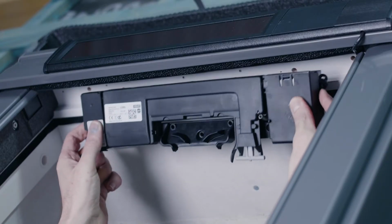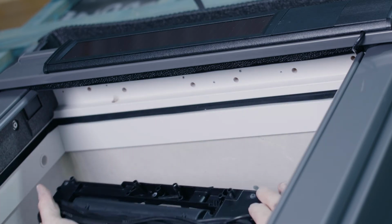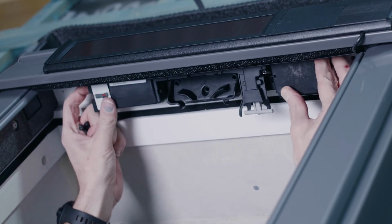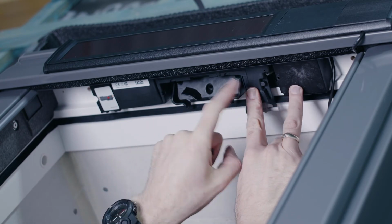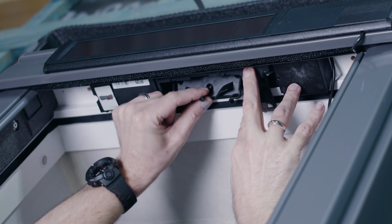So the cable wrapped around, all we now have to do is position that underneath the hood section. Notice we have pre-drilled holes that will tie into the lugs on the motor. So once we have that in position, we're going to use the 3 screws that we took out from the plate at the beginning, along with 2 additional ones supplied to secure the motor to the frame.